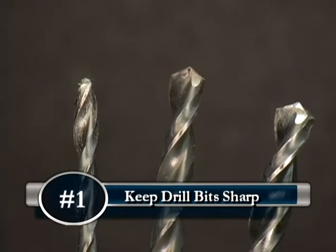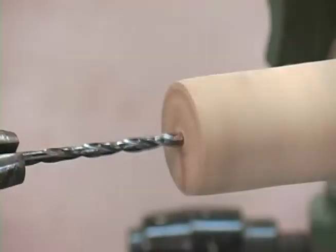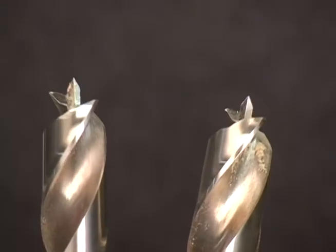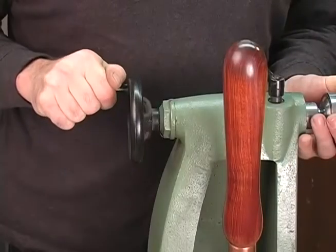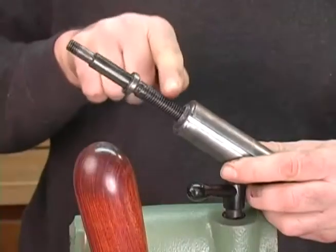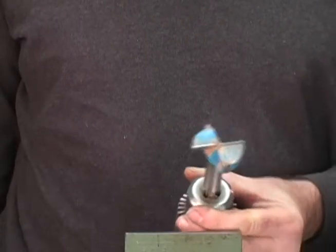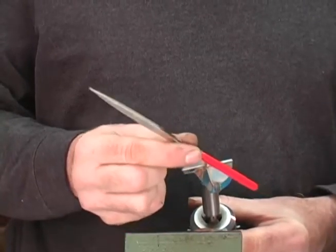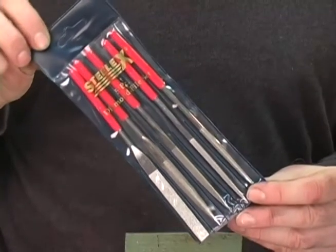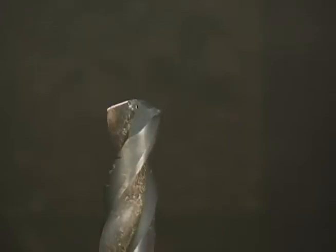Keep drilling implements sharp. Dull drill bits smoke and tend to wander and veer off course, especially twist drill bits and brad point bits. It's also a heavier burden on the tailstock and increases wear and tear on the internal parts. You can sharpen plain Forstner or even carbide Forstner bits by hand using a diamond file — I'll put a link in the description below for this set.